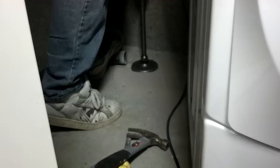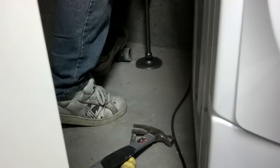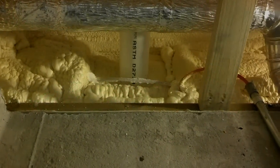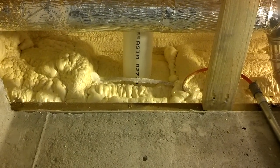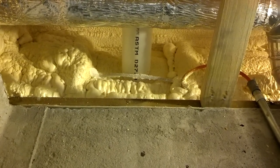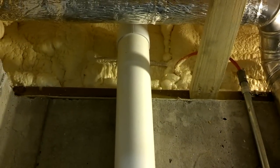Drilling through concrete — it's a dusty, noisy job, but if you just take the time to get through it. In this case we're trying to drill about a 4.5-inch hole because we're going to put a 4-inch PVC pipe down in here right on top of basically the sump line so that we can pull the air out. So there's our 4-inch PVC coming through the insulating foam there. We'll cut that off, put a 90 on it, and come right down the wall there right behind that dryer vent line. We've got it in the concrete about 6 inches down, a couple 45s, attached to the wall, then up a 90 and out into the garage.